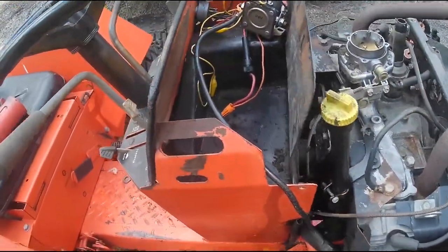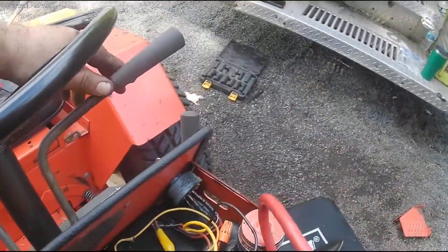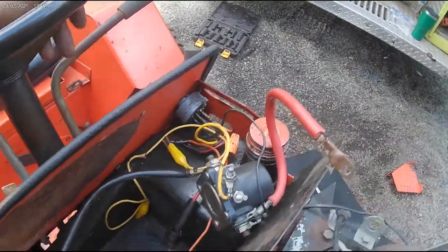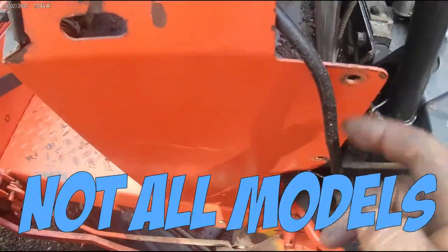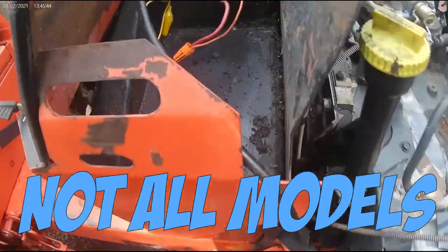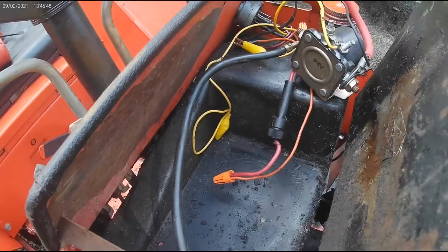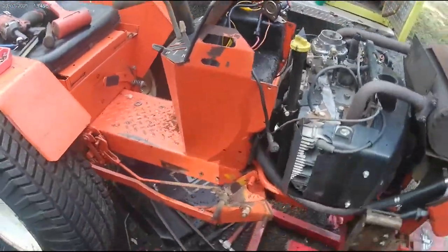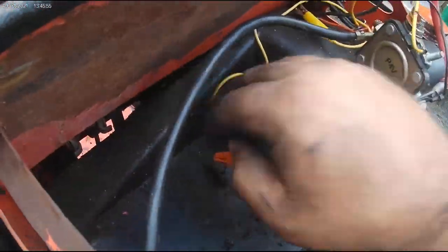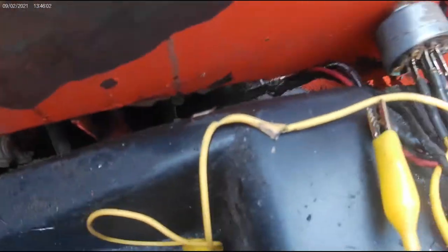All right, for some models, in order to get this lever for the travel to come up high enough, you're going to have to loosen up this heat shield, which we already did. It's a bolt here, and both sides. Take your solenoid off, which we already did. Take your battery out. This firewall shield comes right out. And then now you can move your hydraulic tank forward,